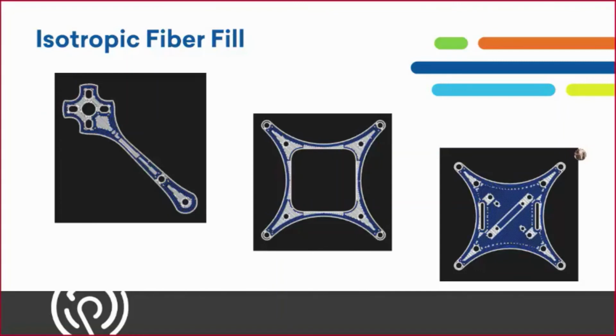Unlike our last image, which is the main plate, it's the bottom plate, we use carbon fiber running through the entire print of that part. That's going to be the main meat and potatoes, the main beef of the frame. That's where our electronics are going to be mounted. And also our arms are going to be sandwiched on that plate. So we used carbon fiber throughout that entire plate as well, except for the top 2 layers and the bottom 2 layers.